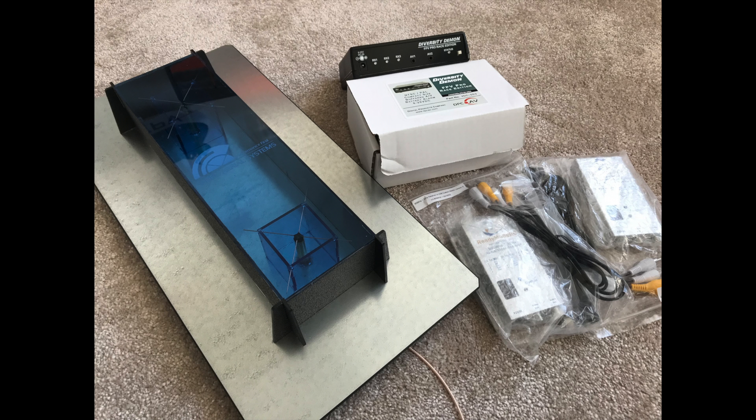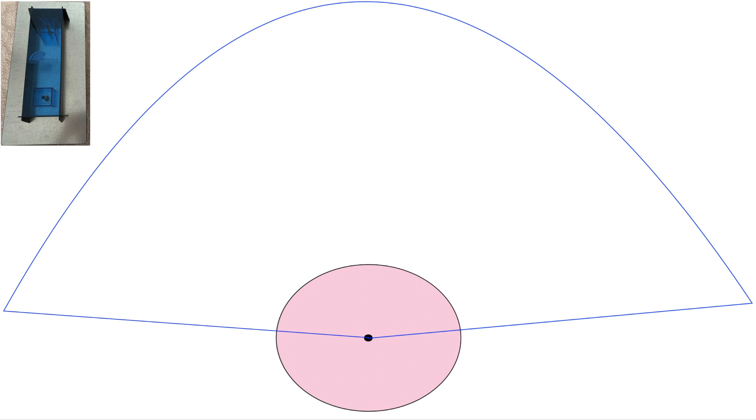High gain antennas such as the Pepperbox are classed as long range antennas — you can fly 30 kilometres plus with no problem given the right conditions and configuration. However, high gain antennas are directional, which means they have a field of view out in front of them. The Pepperbox specifically has a very wide beam width of around 165 degrees horizontally, roughly illustrated by the blue light in this diagram. It basically means as long as you fly in front of the antenna it should be good, allowing you to fly way beyond the limits of the omni antenna.